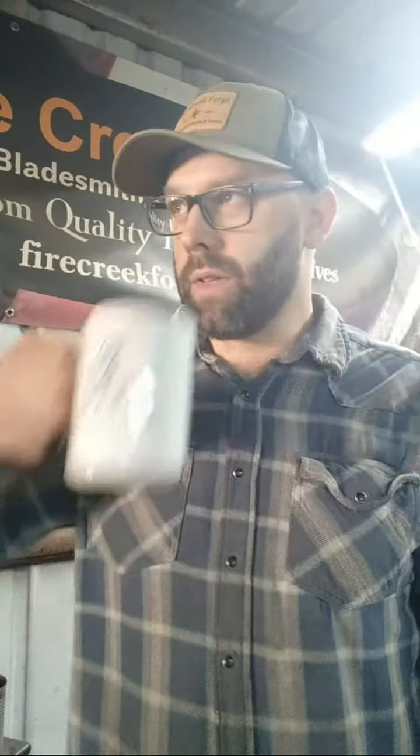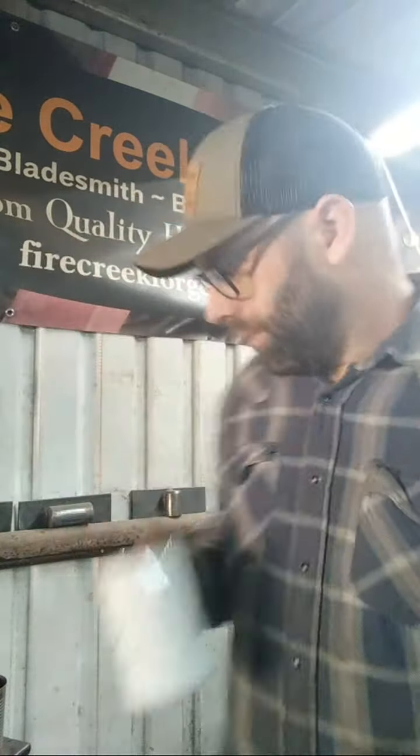And then finally, the affordability. Because it is a common, widely used steel, the more they make of it, the more affordable it can be. If you're just doing a very small, custom run of steel, that's going to be more expensive. So 52100 is widely available and a lot of it is made, so it's also affordable. So those are the factors. Hopefully that explains why. But I still work with some other steels.